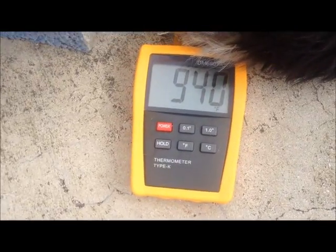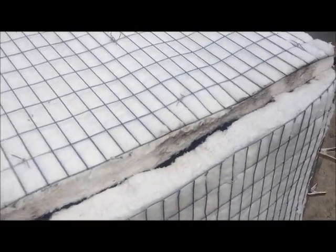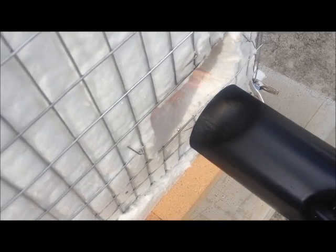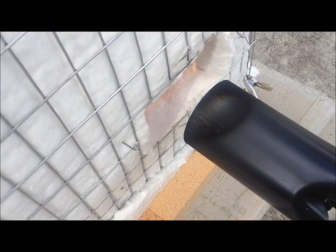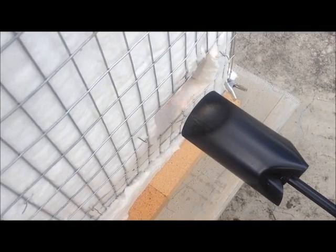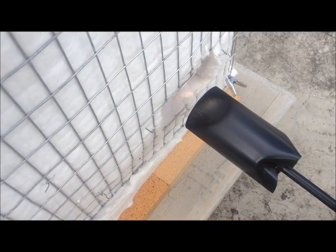It's 1:15 in the afternoon. We're up to 940 degrees. I have not changed my damper setting. I just bumped the burner up a little bit and moved it a little bit further back, and we're starting to finally show a little blue flame going in here. The temperature seems to be rising pretty quickly. I'm going to keep this going up to about 1,290 to 1,300 degrees, hold it there for maybe 20 to 30 minutes, and after that it's rock and roll to the finish.